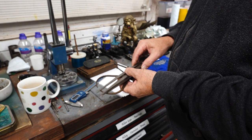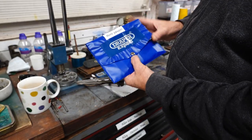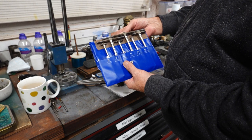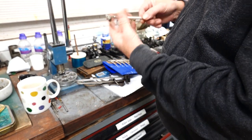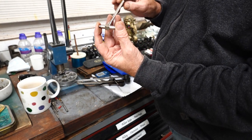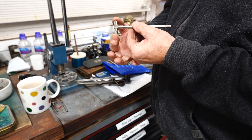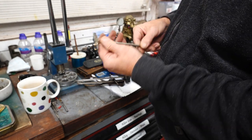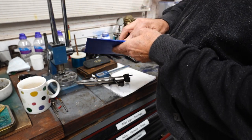Another thing I bought - bore gauges. If you're going to drill a hole in a piece of bar and want it to be accurate, these are quite nice. You flatten the back end, push it into your bar - spring-loaded plungers - and when you've got it to fit just right, nip the back screw up, take it out, and measure with your micrometers. You get an accurate measurement of your bore. They weren't expensive, a nice little addition - though I haven't actually used them.